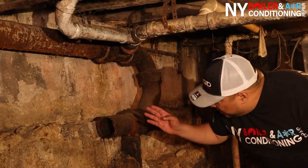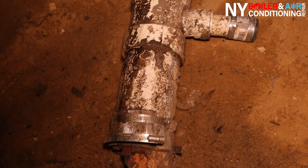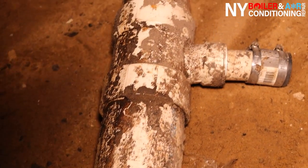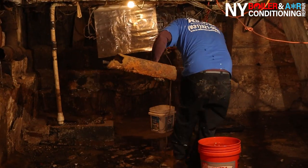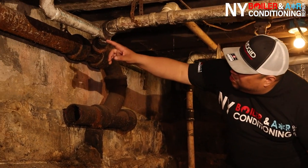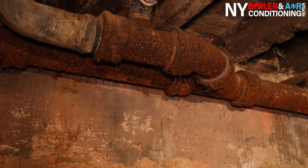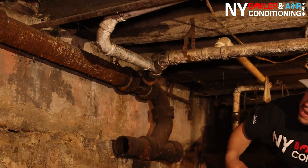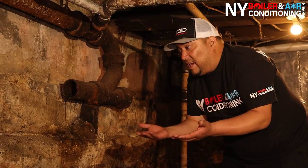You want a nice straight flush cut — look at the cut we did on the pipe, it's nice and straight. That's what you want because you need to put a coupling on the pipe. We call it a no-hub coupling or a husky coupling — there are different types — but you want to transition from soil pipe to PVC. I recommended changing more of it since it's on its way out too, but it didn't fit the budget. The remaining pipe looks like crap on video but it's actually in pretty solid shape; he wants to do that with me in a couple of months.